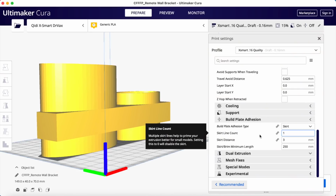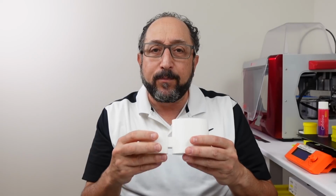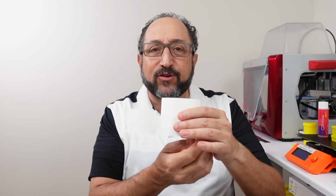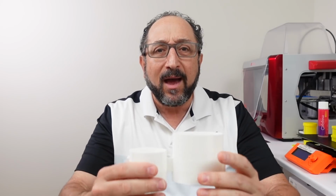Next, and I skipped over support because that's another topic that has to do with overhangs. Many of you have watched other videos about that. There's a lot of good material on YouTube about that, including on my channel. Build plate adhesion. You want to make sure this doesn't move at all. So if I'm printing something really critical with a small surface area, this has a pretty big surface area, I will turn on a brim.